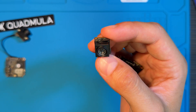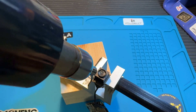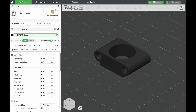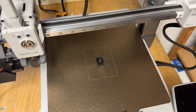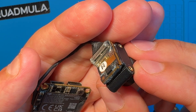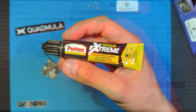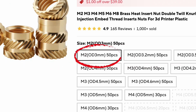Sadly I don't have footage of the original lens removal, but there are plenty of tutorials out there — all you need to do is apply some heat to the lens and it should come right off. Click the link in the description, download and print my lens support, preferably in black PETG. PLA is fine, but PETG adds a little UV resistance which we can benefit from. Make sure to use a dark color to avoid light leaks messing with your image. The lens housing will be glued onto the camera PCB using E6000 glue. Before gluing anything on, install the inserts to ensure you can securely mount the camera to the frame later.